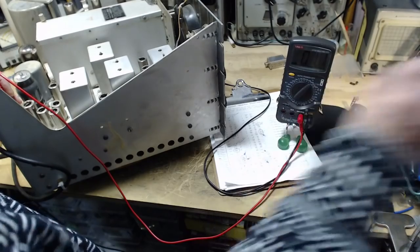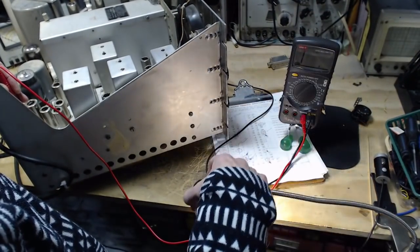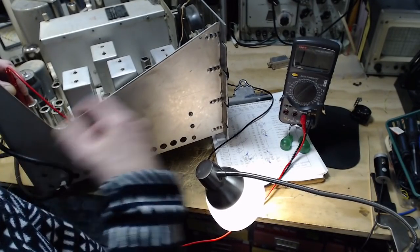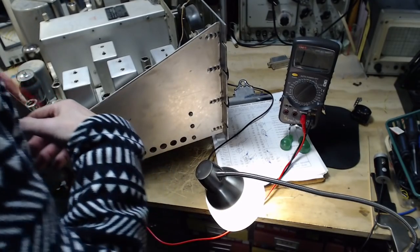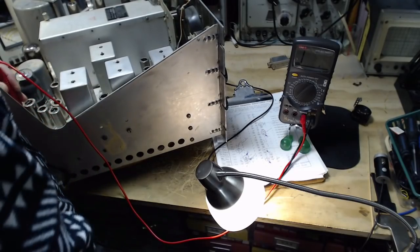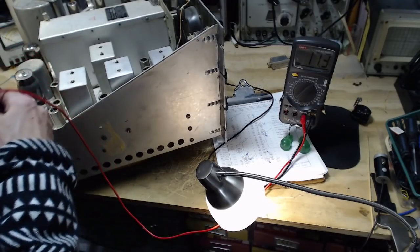1 megohm. And it's really hard for you to see that. You know? It gets a little better somehow. It's a little bit better. It went from where it was to where it is now. I guess that's true of everything in life. Well, there it goes again. So yeah, something wonky here. Cold solder joint or something of that sort going on.